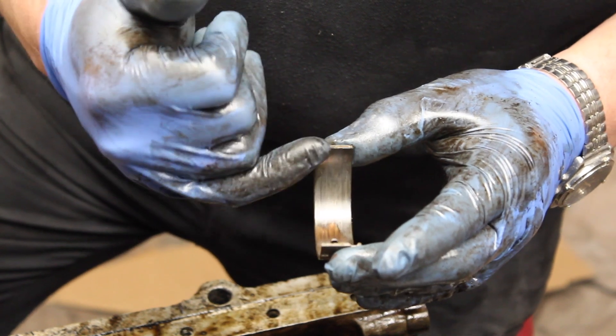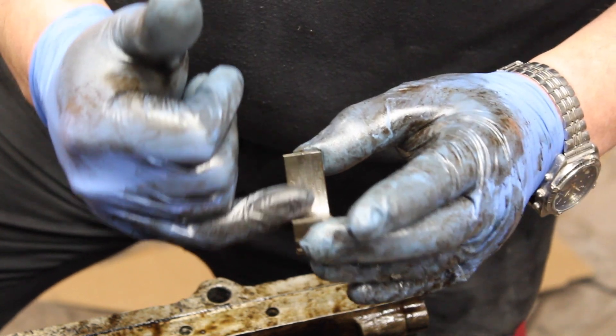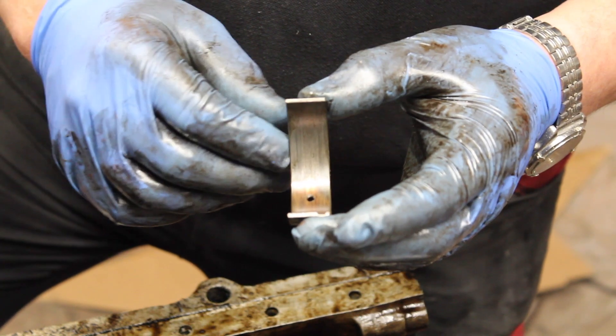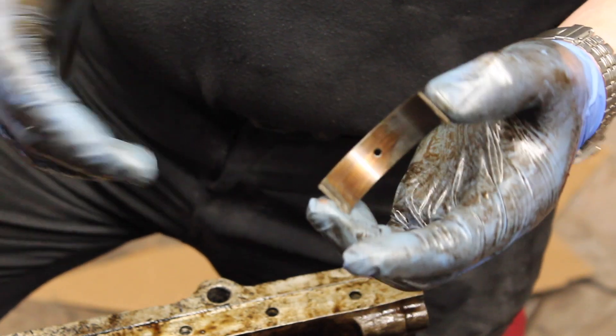As we can see by the silver on this side of the bearing, the white metal on the stroke bearing face is still good — but that would be what you'd expect. The copper is actually the material that is put on prior to the bearing face material. That is the obvious sign that these bearings are scrap.